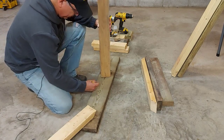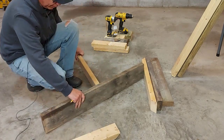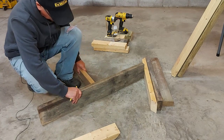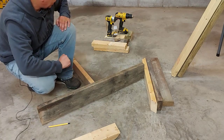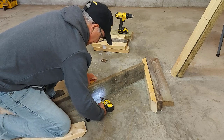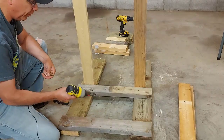This is where the 32-inch piece will go, right on the center. We'll drop it over like this, center our 2x4 upper beam, and drive a screw here and a screw here underneath. We'll do both base pieces like that. Once one is done, we'll do the same to the other, then put our two-foot cross members in place.